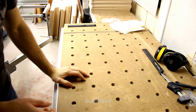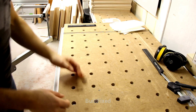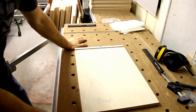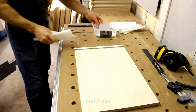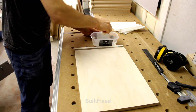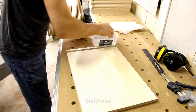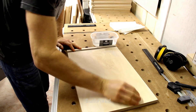At this stage all the parts have been sanded to 180 grit sandpaper. I like to raise the grain before I go to finishing, so for that I just use a paper towel and some water — just get the surface damp. Once it dries, I'll sand again, probably just 220 one time, very light, and then apply a coat of water-based poly.